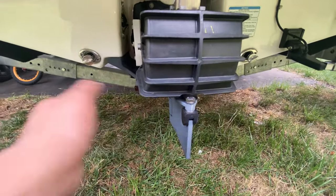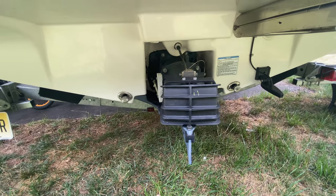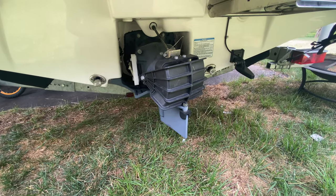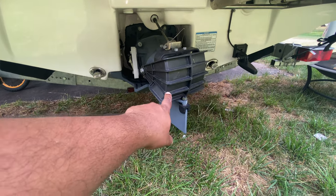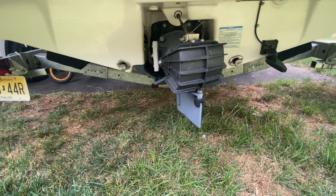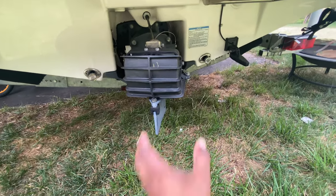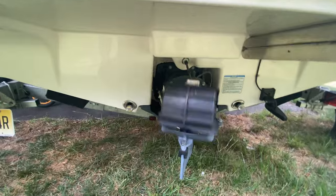This is the water outlet - left and right. I'll show you the steering. Turn all the way to the right - see, it turned that way. Now turn all the way to the left. When you turn all the way to the left, the rudder and bucket turn all the way to your right. When you turn right, the boat will push to the left. When you steer all the way to the right, it comes to the left - that's how the boat turns that way.